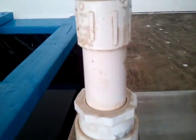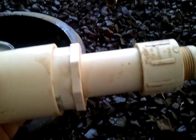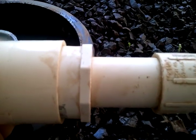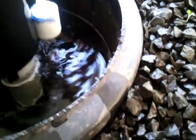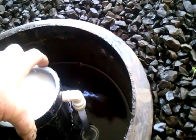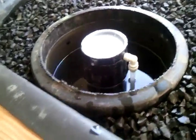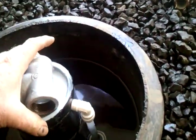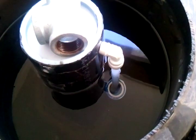This is the standpipe I used to use. What I didn't like about it was this restriction with the inch and a quarter pipe, which is fairly large pipe, but now I have absolutely open two inches. It gets a lot more volume going through here. So that is the answer to the bell siphon blues.